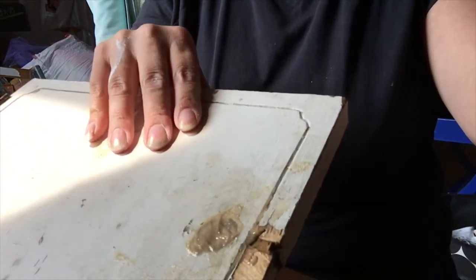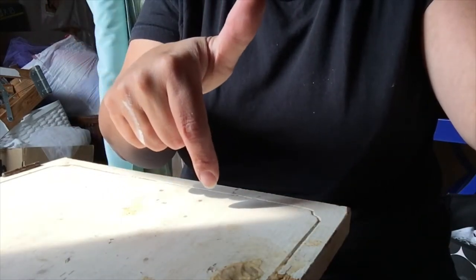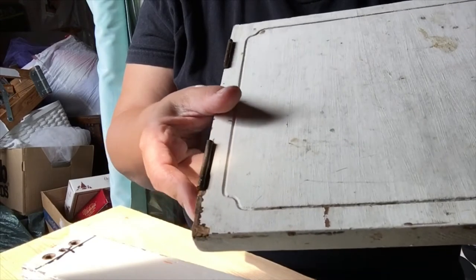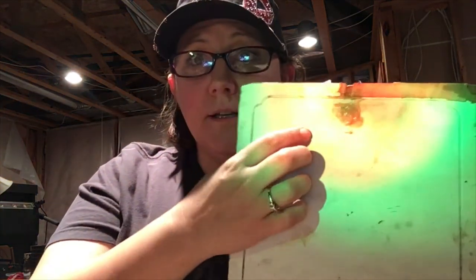You can see I've cleaned off the edges. Then I'll take a palm sander or belt sander to that and get it leveled off — I may need to add a little more in there. This will literally become hard as a rock, and I'll be able to drill a new hole for the handle. In a later video we'll clean up all the damage on this piece. I pulled this molding off because there was no other way to get this sucker open — she lied.